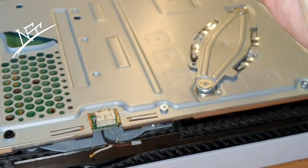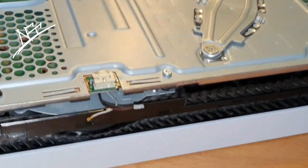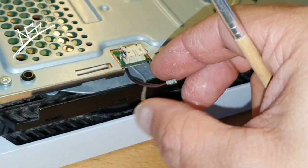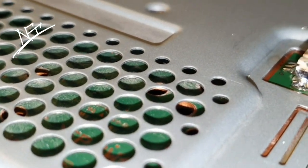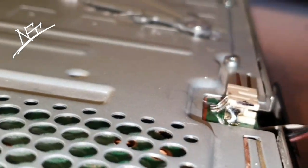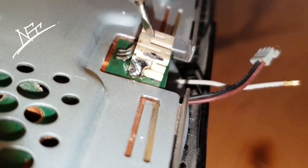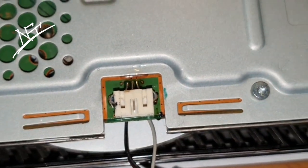This is how I did it and you can see it now very well how this is holding the connector on the right side and on the left side. It looks all just a bit dirty, but this is just normal because I have just soldered it fresh and clean. And that's why sometimes you have some flux around. I'm going to clean this all with isopropyl alcohol. It looks great, guys. It's really holding just perfect. That's how I just wanted to do it.